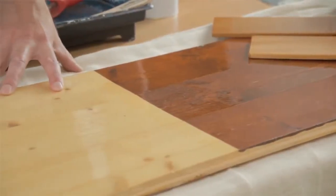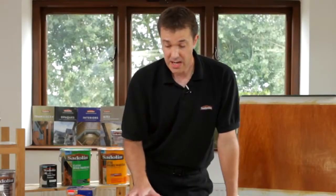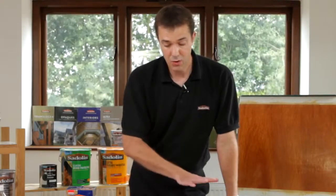PV67 is a very easy to apply but very quick drying system. The first coat takes about half an hour to an hour to dry. Your second and third subsequent coats take about one to two hours to dry, so you can quite easily get the job done in a day. You get a satin or a gloss finish depending on what you want, and your final finish will always be determined by the final coat that you apply to the floor.